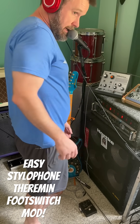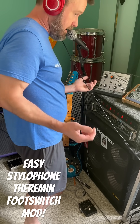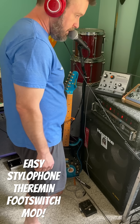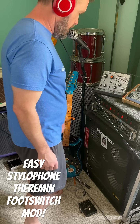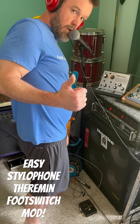Same thing on the foot switch, then just run your momentary switch in. Polarity doesn't really matter — you're basically just creating a loop that simulates this one. So you can use either one and you can unplug that. Try it out, have fun.